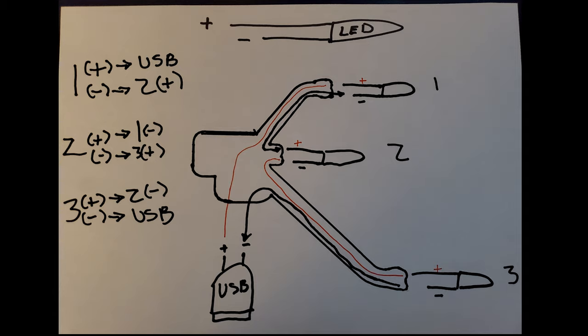What I've done so far is taken LED number one, cut the leg back a bit to shape it to the frame, cut the wire very long since it's going out of the frame and into the USB, put some heat shrink on it, soldered the wire onto the positive LED lead, brought the heat shrink up to cover the connection — we don't want any bare metal — then heated it with a heat gun. That's where we're at so far.